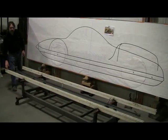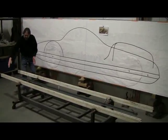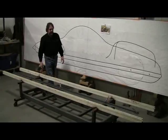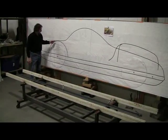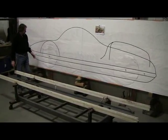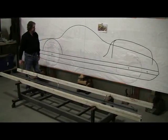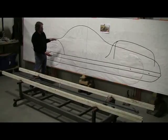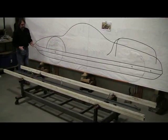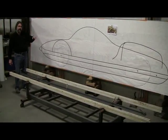This is unistrut, which is a very common material. We put a little slider bolt boss in there and we will put angle iron pieces — inch-and-a-half by inch-and-a-half by eighth-inch wall angle iron pieces — at assorted spots along here. Those angle iron pieces become the base for rectangle boxes that we'll make out of angle iron, and the size of the boxes will be determined by the drawing. Right here we could have a really big box that would support the top of that roof structure, which is plexiglass in this case. We still need that line there, so we've got to do this. This is our side view drawing; next we're going to do the top view drawing, and between the side view and top view drawings we'll be able to determine how big the box structures will be. The box structures all get put in the exact same place as they are noted on the drawing.